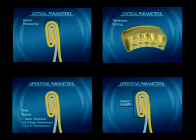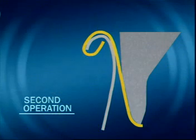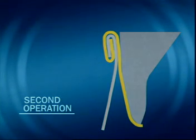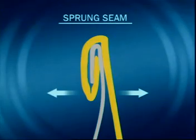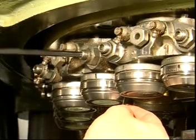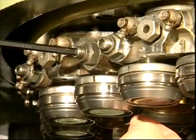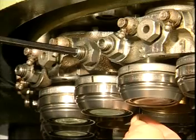A large seam thickness value and 100% tightness rating, indicated by no wrinkles but still having a high free space, can indicate the seam is over tight and has led to the seam springing apart. This is called a sprung seam. In this case, the second operational roll should be loosened. Any roll adjustment should be carried out at the peak of the respective cam.